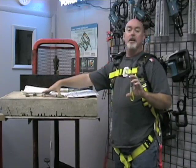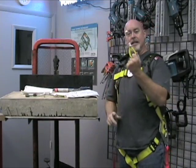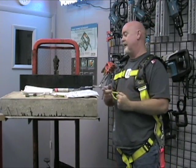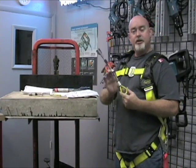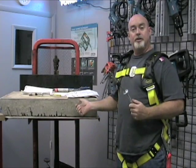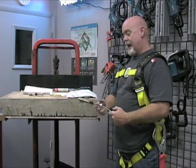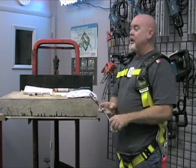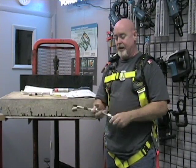The 5,000 pound anchor, you can actually drill the hole and put it in — one person per anchor point. If you're using the 10,000 pound anchorage point, you're going to drill your hole to the specified depth and diameter, which we will go through and do. Then after you put your anchor in, you would be able to go to another part of the building, as long as it's within the spec for doing a horizontal lifeline.